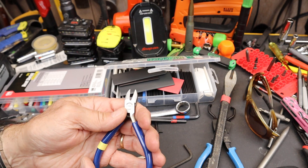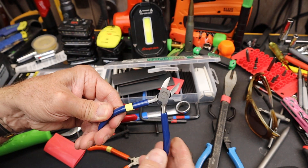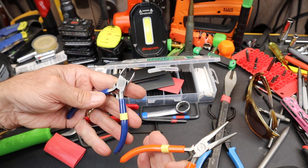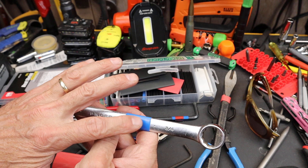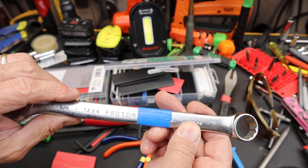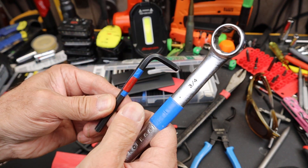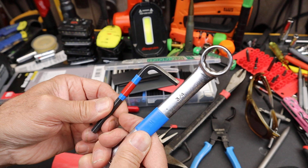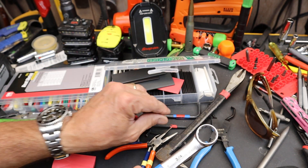I've also done tool identification. Here are some Jensen pliers — if I want to separate these out, I've got little yellow bands I can place on them and hit those with a heat gun. That heat shrink makes them something that is identified. I did it with wrenches too — this tells me right away it's a fractional wrench. What happens is I have a pile of wrenches and I can easily sort them. This is nothing but blue electrical tape, a little thicker. Blue denotes me and red denotes metric, so if it's just regular blue it's fractional, and if it's blue with a red band it's mine and metric. I learned that a long time ago marking climbing equipment, so you could easily look through the rack and pull out all your stuff.